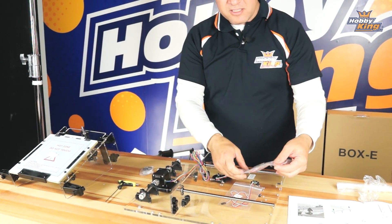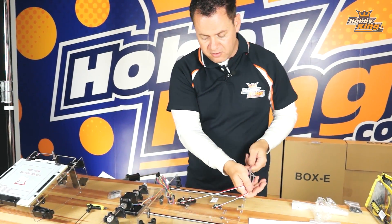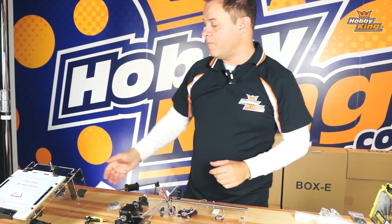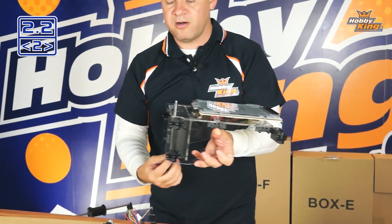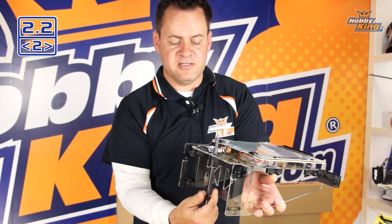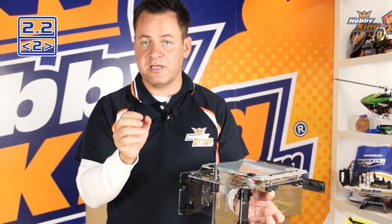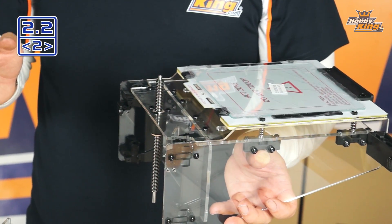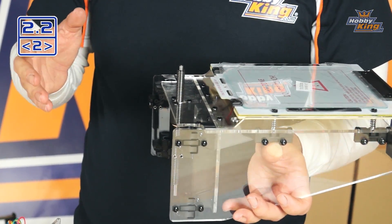With the rods installed, take the plastic off the wires and pull them down and out of the way as we slide the panel up. The next step is to thread the lead screw up approximately two inches. The reason is that everything is acrylic laser cut, and even though the holes are precision, there's always a little bit of play between the threads and the acrylic. This is intentional in the design to allow tramming so the machine runs extremely smooth.